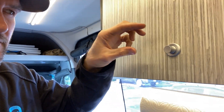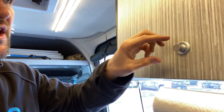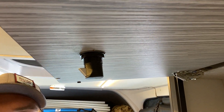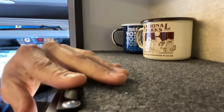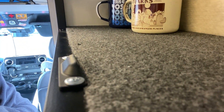These are direct replacements. You unscrew and remove — I think two small screws on your standard latch — pull it out. This slides in, you put a threaded back nut on and that holds it in place. You can either reuse your existing tabs here and bend them slightly, or we're going to supply you with some catches that you can replace.